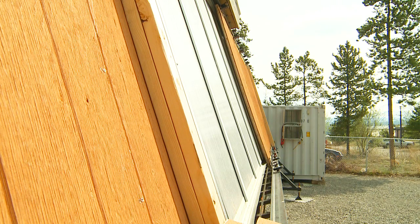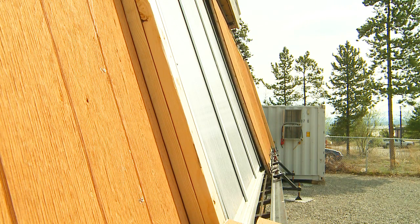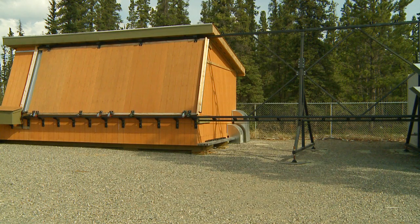There are two layers of vacuum insulated panels sandwiched inside the shutters for this greenhouse. What do these shutters do and when do you use them? In the summer we've got so much daylight that we do occasionally close them just to keep it cool in the greenhouse. In the winter, because we already are lighting the greenhouse, we can close them when it's really cold out just to conserve heat.